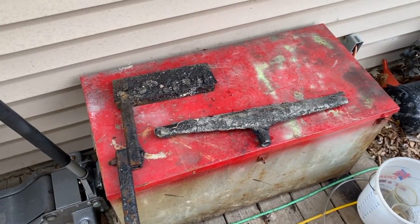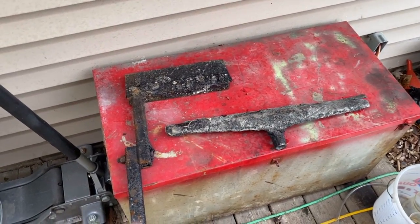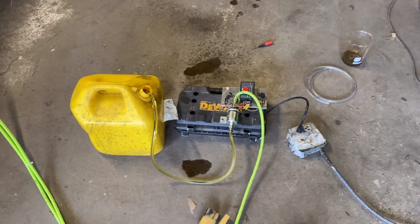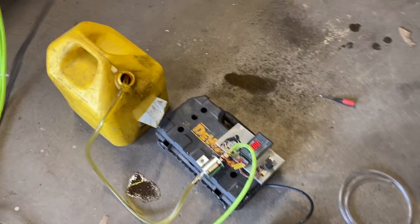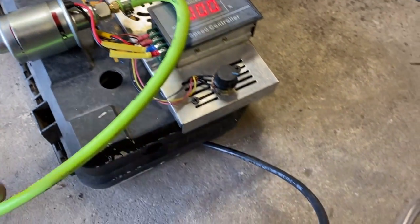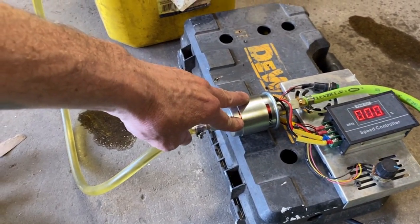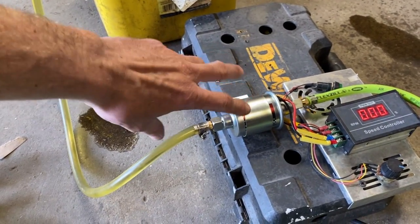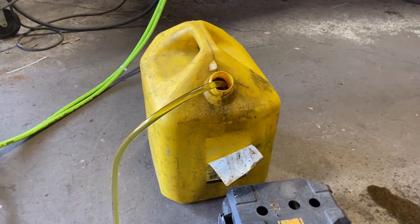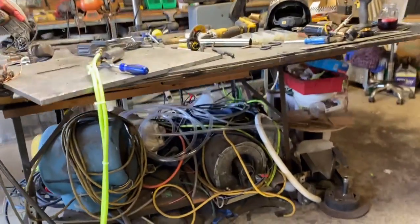We're going to go with a 40-foot coil on the steam coil versus the 25-foot, and we built a whole new burner. In addition to that, I'm experimenting with some different fuel pumps and power control schemes. This pump right here is turning out to work just perfect. I want people to be able to take a little box, sit on the ground, stick a hose right into a diesel can on a job site, and then be able to fire up a torch.